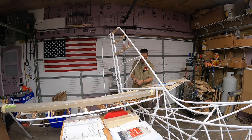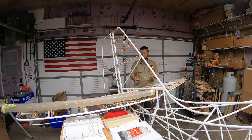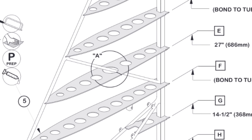The backs seem to be machined quite well to fit almost flush to the back. There was one that had a proud weld that I had to take a little bit more out of, but I would start on the front first, take that out where you need to, and make sure the back end is flush with the back of the square tubing on the vertical stabilizer. Filing, test fitting, filing, test fitting — this one needed the notch cut into it, which was pretty simple. You can just kind of line it up and cut your notch the same diameter as the tube that it's going to go over.